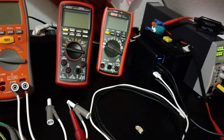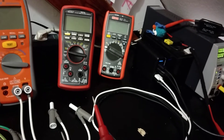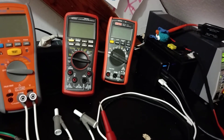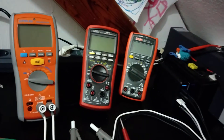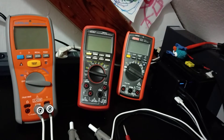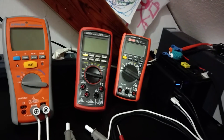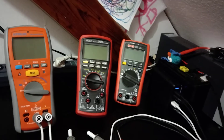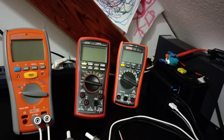I've observed this in many different locations. In the lab there is obviously always some place where the non-contact voltage works better and some place where it works worse — but that just means I cannot really trust it. Now with the bunch of cables, you can mark the cable that you want to find, and then you make a confirmation reading: switch everything else on, leaving the circuit you want to find off, checking again if the cable is the only one that is off. You found your cable. Switch everything off, install the junction — everything nice. That is a good use case.